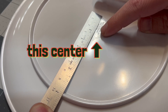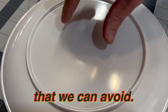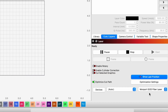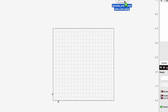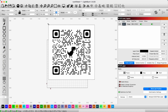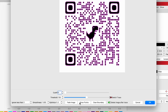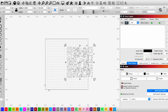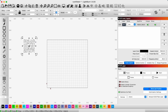I want to avoid the center, so the center is going to be an inch and a quarter. I need to draw a tool line that we can avoid. So here connected to our fiber laser and our fiber laser template, we're going to go ahead and import the QR code we're going to use. What I'm going to do is trace this — QR codes trace really well because it's just a black and white image, so you don't really need to do any adjustments. Hit okay and that's going to be our QR code. Obviously it's going to be shrunk down a little bit more, but we'll get back to that.